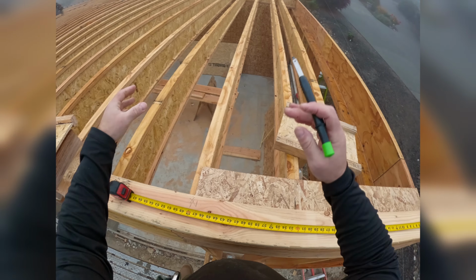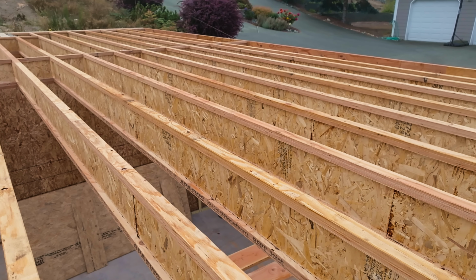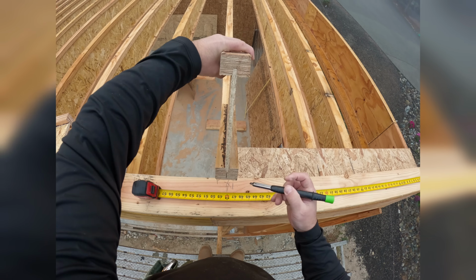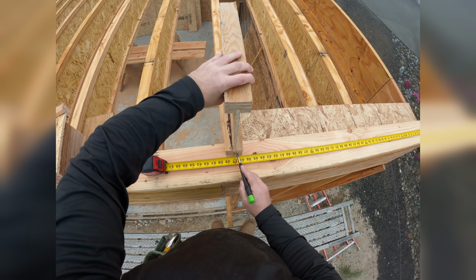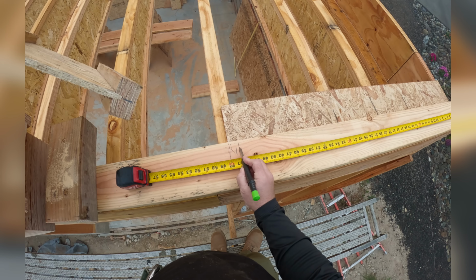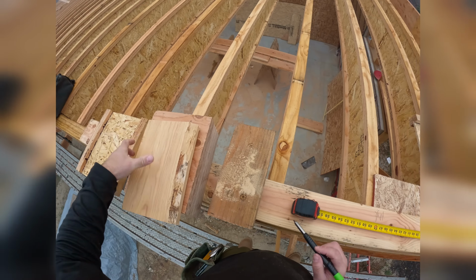Now this section here is all 2 5/16, 2 3/8. It's a higher series Roseburg joist. I think it's a 70 series. So same thing. There's center. If I go center on 4 foot, then I would just go half of that back. See the difference there? Let's just exaggerate this since I brought up a whole bunch of wood.